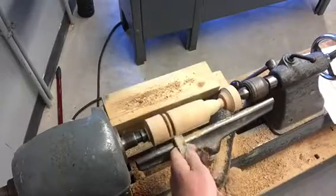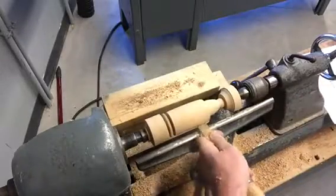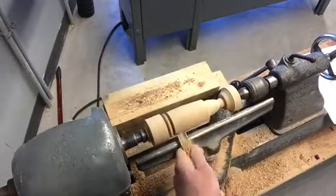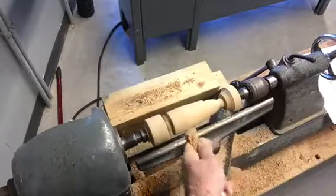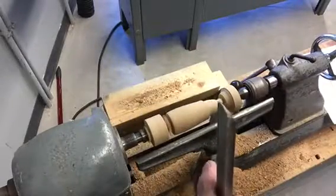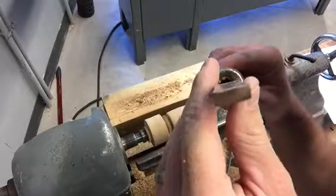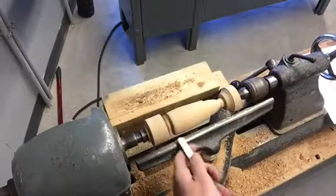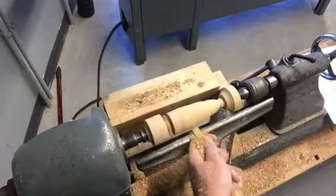This tool I have here is just a bigger rounded over gouge out tool. It just works a little bit better for longer areas. It just cuts it a little bit evenly, or more even, so that's why I'm showing you this tool. I like to use this one when I have a little bit bigger areas that I'm working as well, so just getting that down to a little smaller. And then the next one here is similar. It's just flat on the top. Again, this one works really well for longer stretches, because it's not as small as what the previous tool was. So these two work really well for when you're doing a little bit wider areas and you're just taking down big sections like this, trying to take off a lot of wood.